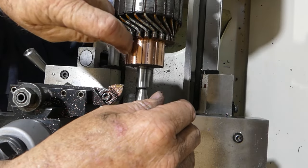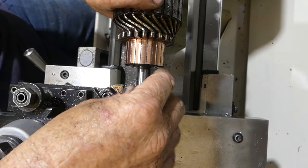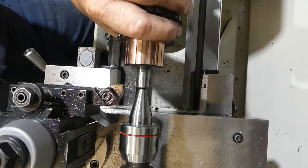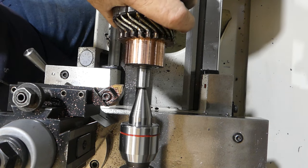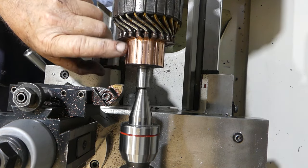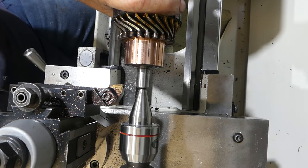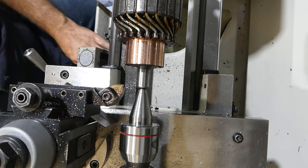You can see how it drags across the lines there a little bit. Now, there's a point for discussion. We were having a discussion the other day. Blake does a lot of 12 volt stuff, and he said undercutting the commutator, in the guts there, on starters you don't do it, on generators you do. So what do you think about that? I'll give it another polish, eh?